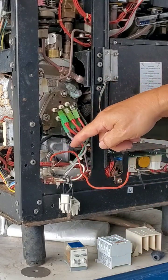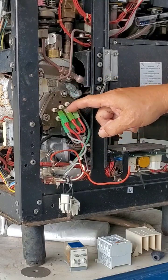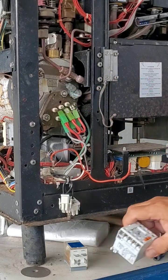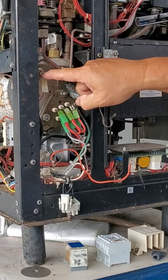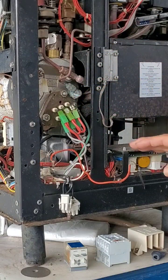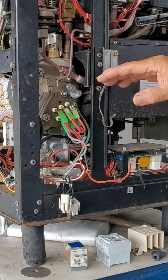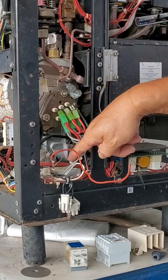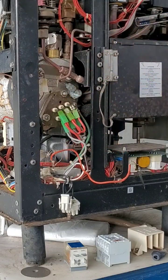Then it goes from the switch to the heater. The only thing that turns on these contactors is that it's also hooked up to the water level probe. The water level probe senses the water, so what happens is the water fills up the tank. Once the tank reaches this level, it tells this switch to turn on — it's okay to turn on — and it turns on the heat.